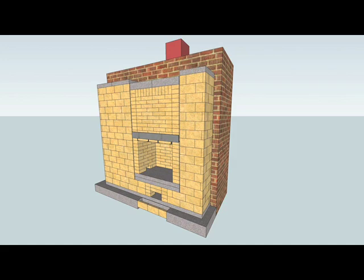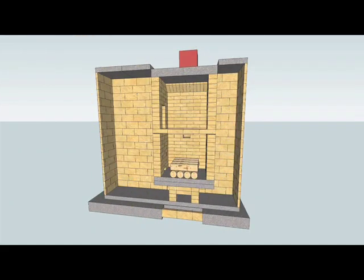a masonry heater. A masonry heater works differently from a traditional fireplace because of the path the flue gas travels. Wood is burned in the firebox of the heater and combustible gases are burned in the secondary combustion chamber immediately above the main firebox. The design of the firebox, secondary combustion chamber, and the insulative nature of the fire brick allow for combustion efficiency that can approach 98%.